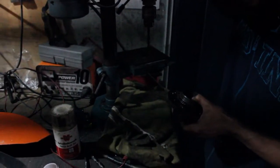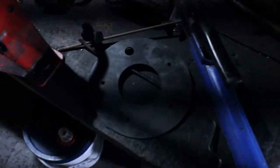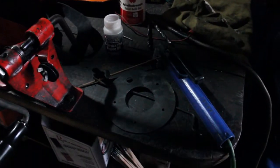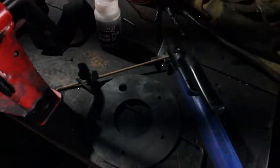We are on 9.5 so we must drill it one millimeter bigger to 10.5. We're probably going to drill it to 10 first and then to 10.5, and from there we will tap it. These small holes are just pilot holes, so we just drill the pilot holes and after that drill it up to 10.5. We drill it from 5mm up through five, six, seven, eight, nine, ten, ten point five. So yeah, enjoy the process.